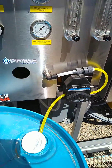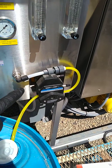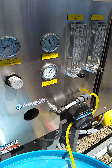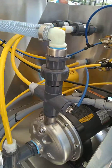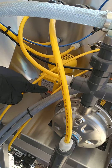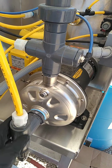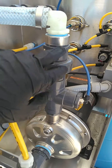Polymer dosing. Polymer is here, dosing pump. This is water in front of the polymer, water after the polymer. Polymer mixing system is back here. Yellow pumps the polymer dosing pump. Polymer feeds into the pump on the feed side, mixes in the pump, and adds more water after the pump.